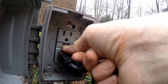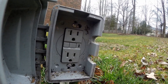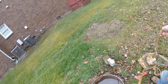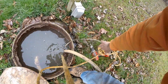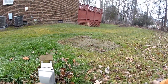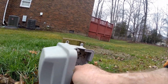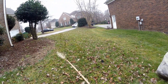When you try to reset it, it just won't reset. So if we unplug the pump and reset the GFI, the GFI is working great. We're going to lower this pump down into the pit - just let it go all the way down to the bottom, keeping our cord out of the water. Now we're going to plug this pump in and see if it trips this as well. Nope - you can see it's kicked on.